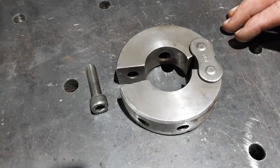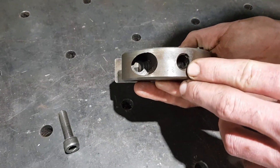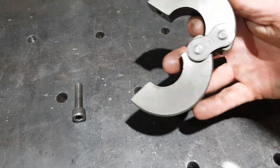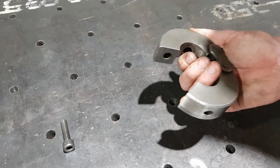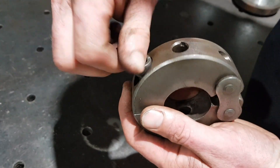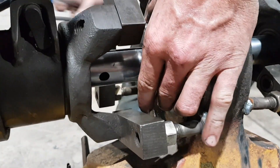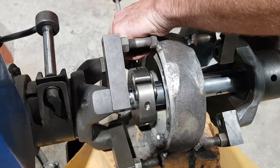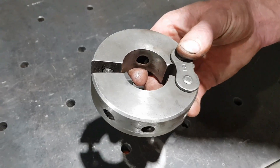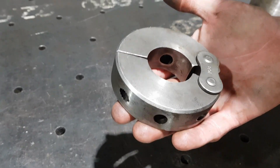This is our shop made tool extension clamp — just a piece of solid bar with a chain link to join the two pieces. I can run a 12mm tool in one side and a 10mm tool in the other. That was made one night after the standard Sir Mechanica one failed. Being that it is steel, it takes a lot more punishment, it's very easy to get on and off the bar — just one bolt straight through, tighten it on and it's done. By far ten times more robust than the standard one you buy with the machine. I made this in the first month of owning the Sir Mechanica machine, as I found the standard one just wasn't up to the task.